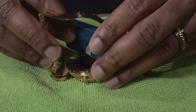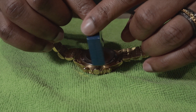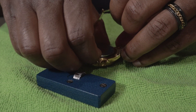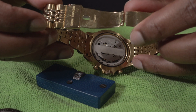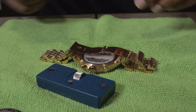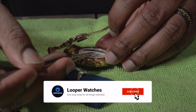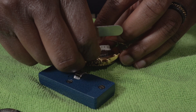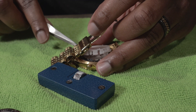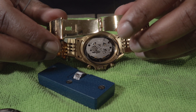Some watches are beyond tight — this one wasn't too bad. Now you just unscrew it. All right, now we got the watch open. Just pop open this retainer, take the plastic retainer off, and then you have full access to the movement and you can see that little battery right there.